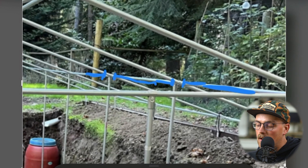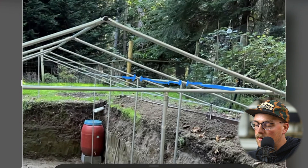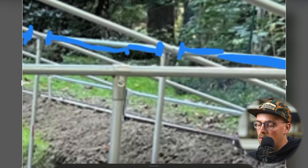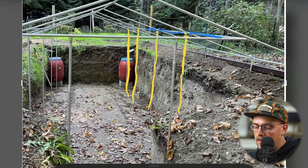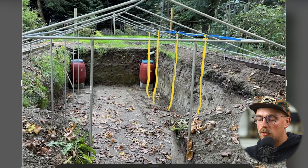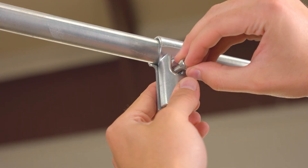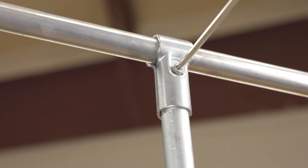That's how he's doing the sides of this greenhouse roof, which is really cool. We can see here that he's grabbing on to those horizontal spans using the Maker Pipe T connector, which basically just joins two pieces of conduit together. He's grabbing on to the horizontal spans, and then there's a piece of conduit that terminates in the T and then goes all the way down to the ground. That's how he's grabbing on, and all these verticals are supporting the roof of the greenhouse. He's got, I think, 10 total verticals going down to the ground, all connected by this T connector, which has the through pipe running through the top of it and then the terminating pipe coming out of the bottom going down to the ground.